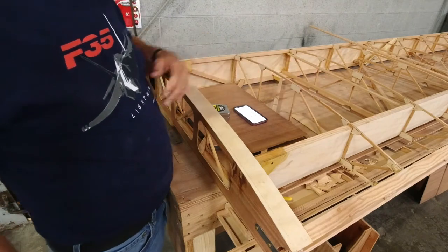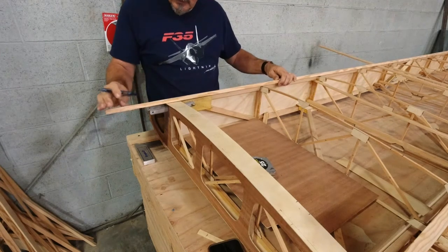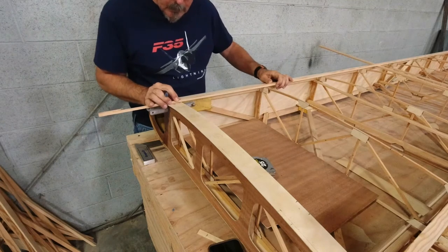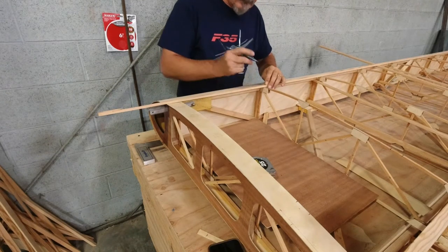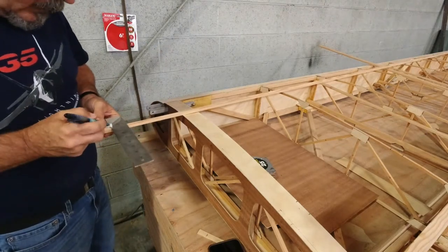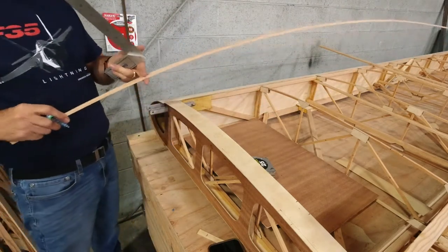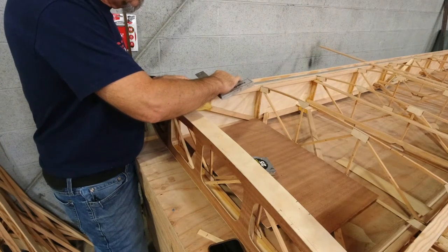All right, first things first, let's cut that cap strip. This front piece is 1/4 by 1/2, RS3. And so I'm gonna cut that first. And my piece tapers a little, so I need to pick where the first mark is here. So it's basically going to go from here to here. I'm going to cut that off. I've got to get all these prepped so when I get ready to start epoxy I get them all in at the same time. So that's my front piece there.